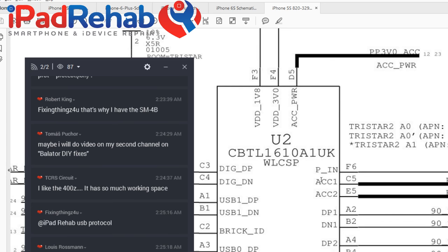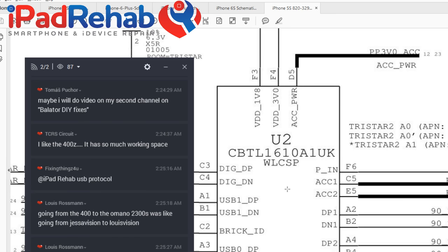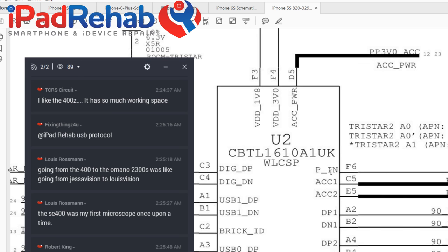Charger voltage, hey bro. So my guess, and this is totally just sort of theory and hypothesis, as to why TriStar gets messed up all the time, one of the reasons might be that this isn't really meant to handle the transfer of the 5 volts to a charging system. I don't know what the inside of a chip looks like, but let's just say it's going to be a little dot that's going to be like, hello, is anybody there? And it's just getting a plus or a minus. So in that case, you're not going to have a big fat trace like you would if you were thinking about a battery power line or something like that. You're going to have just like a little checkbox.